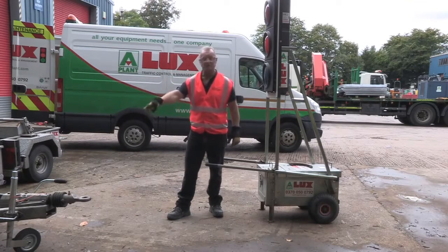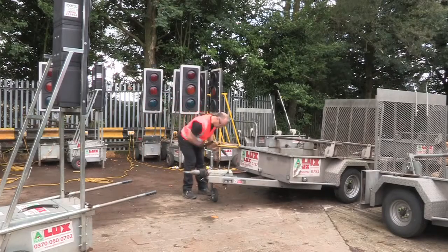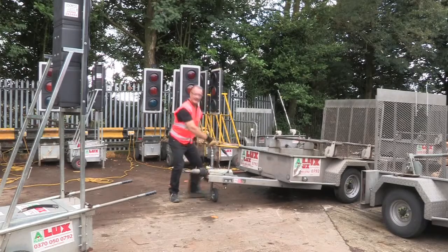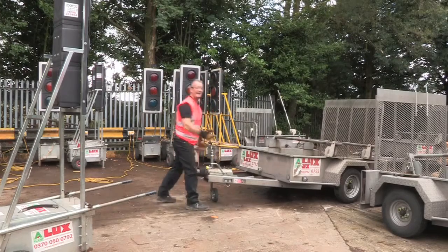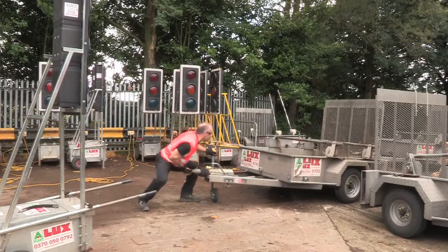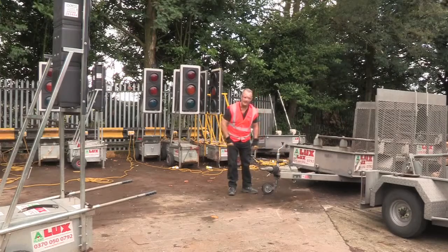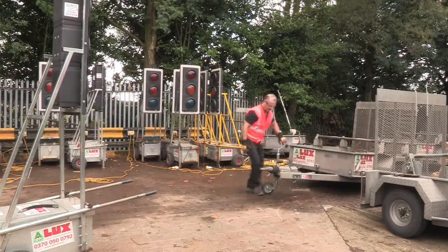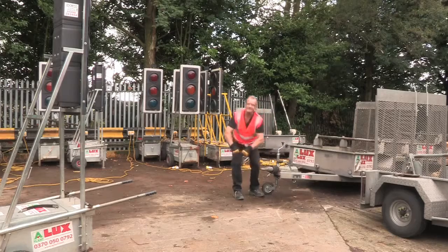Again, shifting these trailers with a jockey wheel. You know, winding these like this and you're doing it there. Let's get in that position there for winding them. Handbrakes is pushing and pulling there. They're never easy. And again, pushing and pulling this. Foot facing, two hands, and tip and drive to start the movement. What I'm not doing connecting up is that. Pull it that way or push it that way. Foot facing the direction, not twisting.